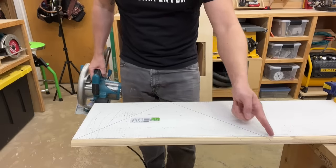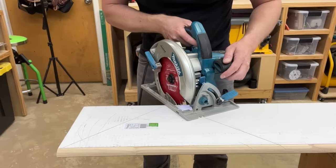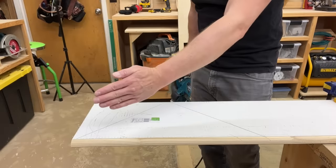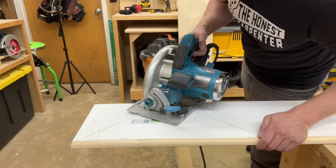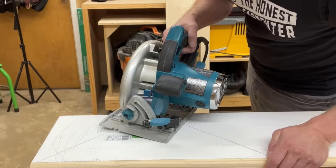This effect can be compounded when you start using the saw to make angled cuts. Inside miters or outside miters will often exacerbate the guard hangup because lateral pressure on the guard further skews the swiveling effect. Sometimes it's really pronounced — you can't even really get the cut started. So in situations like this, carpenters will often manually lift the guard before starting the cut.